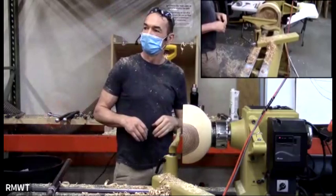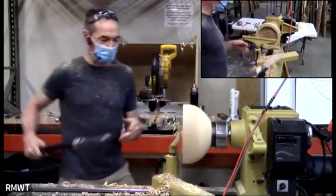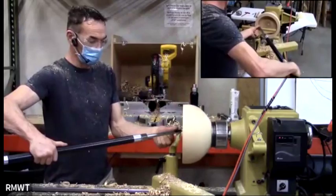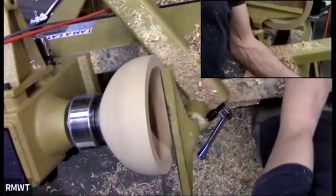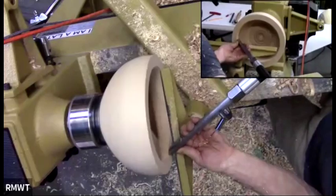How to stop the skidding? Okay, sure. So the gouge starts almost flat, thumb on the tool rest, physically on the tool rest, not on the tool. I can get away sometimes with it not being on the tool rest, but then it'll slip a little bit. So right here. And then once I'm into the cut and the tool is stable, my fingers are now jamming the tool, which is not good. My fingers right in front, these are jamming. So you don't want this effect where they're jamming it. As soon as I'm inside, I twist my hand, open my flute, and let it go forwards.